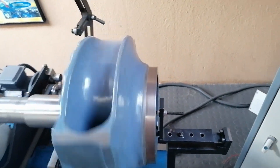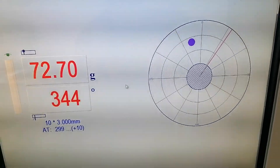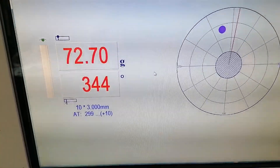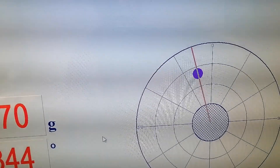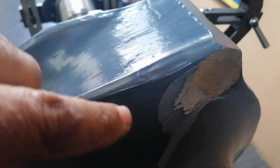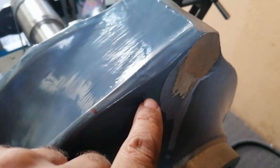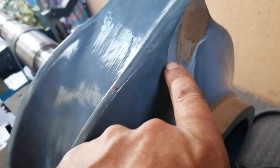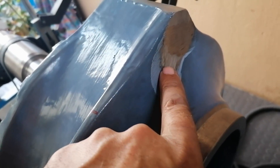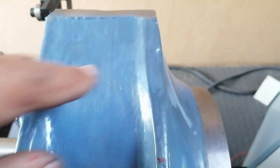She's coming to a stop. The cursor is at 344 - which is in the center - and if I bring it here, I can see I must take off material in this region here once again. Remember this mark. The weight is definitely in this region, and I won't be surprised if this weight will actually travel more this way. So now I'm going to grind a little bit over here, about the same amount I took off there.